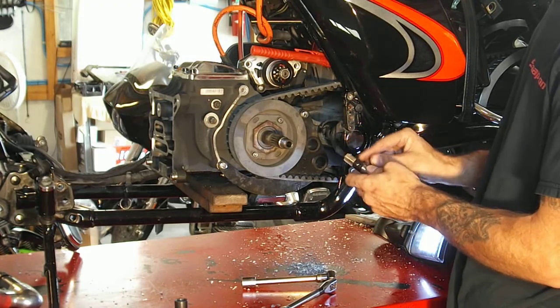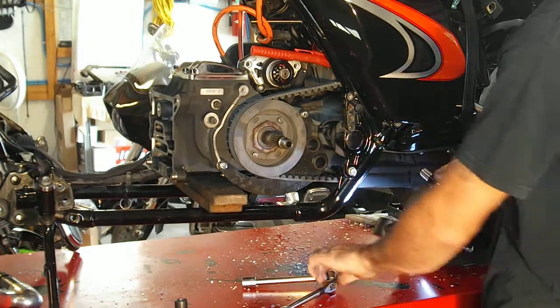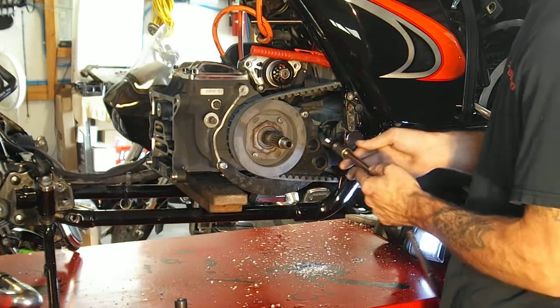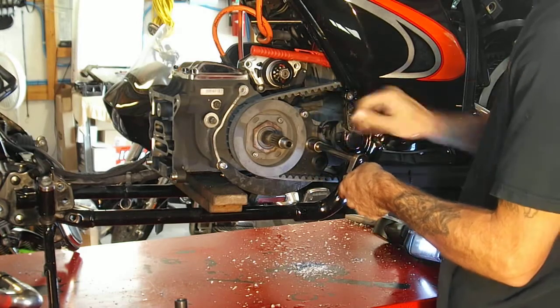So you don't want to go too deep and you don't want to be too shallow. It's important to mark your tap. I've already deburred the holes and SNS has made this jig so that a 5/8 socket fits on here and fits right into the jig so you can tap it dead straight. I strongly suggest doing this by hand.